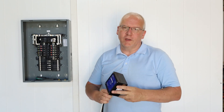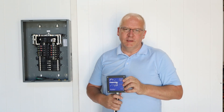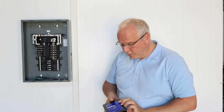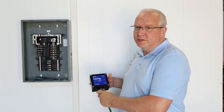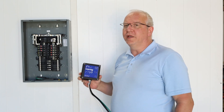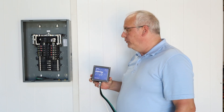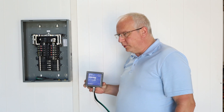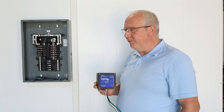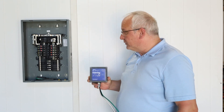Hi, my name is Sean, I'm with PSP Products, and in this video we're going to talk about installation of the Vortex Series R surge protector. This is a Type 1 device, which means it's internally fused — it doesn't need any overcurrent protection, so you don't have to install it on a breaker, but installing it on a breaker makes it easier to change out if you should ever need to.